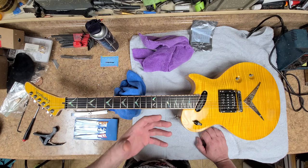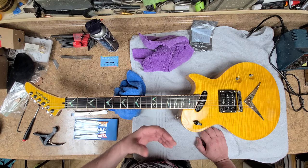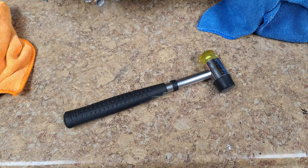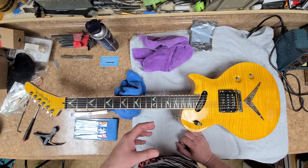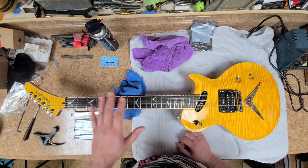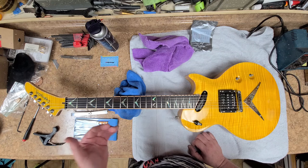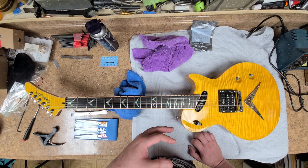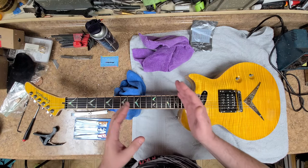The problem was installing the frets. Old frets came out easy. New frets went in really hard and difficult — I really had to press them in. I pounded them in a little bit, but not with a heavy hammer. I have a fret hammer I use to get them started, then I pressed them in with my press. That gave me a nice, secure fret. There's also glue inside the fret slot — I always do that regardless of how tight the frets are going in. I use thin CA glue mostly, but in some cases I use thicker CA glue.